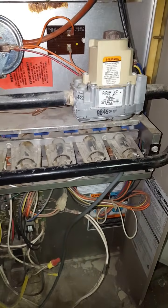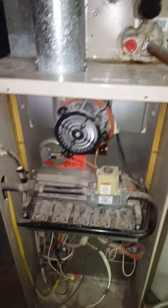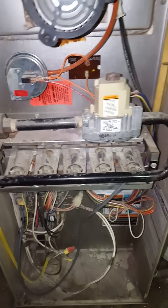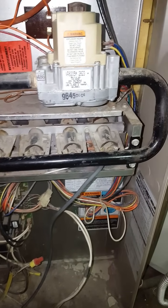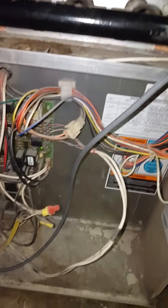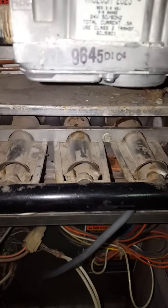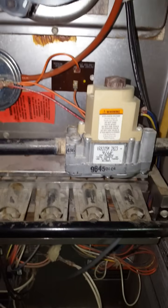I did a lot of research on the internet and YouTube videos trying to figure out why my furnace would not fire up for heat. When I fired it up, all I could hear was the gas blowing but there would be no spark. I found out that this model does not have a pilot light but has what they call a spark igniter. This cable right here is connected to the spark igniter, which goes to the control board. The control board sends a signal to the igniter and you can hear it arc, then the gas flows and fires up — and it wasn't doing that.